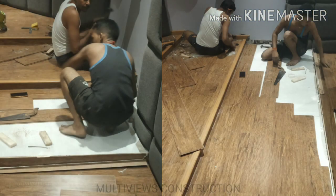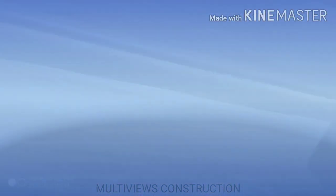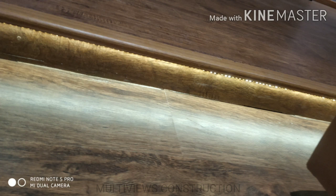Next, we will start the floor work. On the floor, we will fix the wooden floor tiles in the appropriate size. The plain floor foam is filled to a 10mm thickness. Each tile is locked together — you lock the first tile, then lock each subsequent tile into the corner. If you have a profile piece, fix the corner with a corner piece and fix it with a 1-inch nail. Then you can fix the strip plate along the edges.